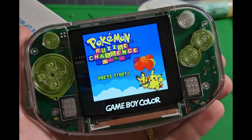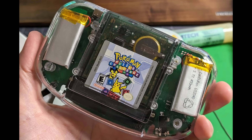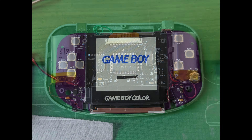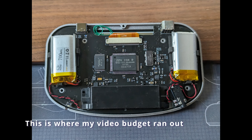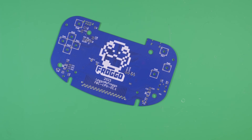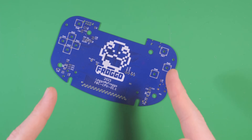I was ecstatic at this point. After two months of nearly non-stop work, my grand vision was becoming a reality, but there was still work to be done. V1 had a couple issues, including somewhat noisy audio, a flaky CPU reset circuit, and an on-again-off-again soft latch power circuit that needed to be revamped. But after three more board revisions, we've finally landed here. Let's build one.